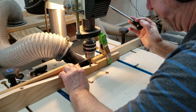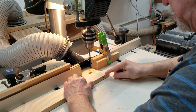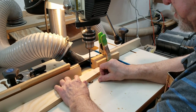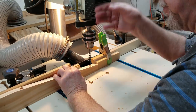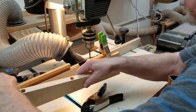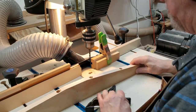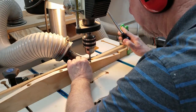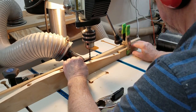I switch to the quarter inch bit and drill all the way through. Since the shortest holes are the last ones I did, the stop block is already in position for them, so I start there for the next set of holes. Each brace has three holes on each side — 6 holes times 2 braces, 12 holes, times 2 bits equals 24 holes I drilled. I'll make a deal with you: if you'll take my word for it that I drilled 24 holes, I won't ask you to watch them all. Deal? Deal.